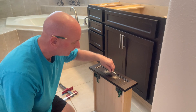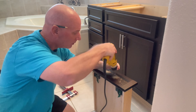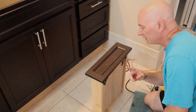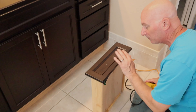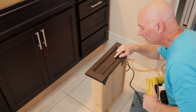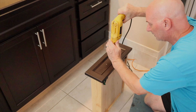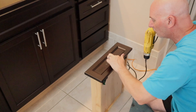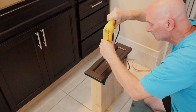I'll put a starter mark in first, then take the jig off — now I have two little dimples on there. I'll get the small drill bit. This drill bit's a little bigger in circumference to give more room, because these drawer pulls are not all the same — the stems are off a little bit. Some of them are off an eighth of an inch, which is a lot when you're set at three and three-quarters on the jig. That's why I went with a slightly bigger drill bit — it gives me a little more latitude to shift if I have to.